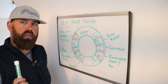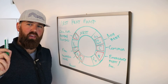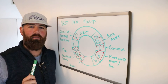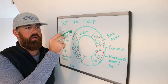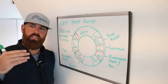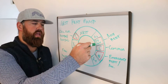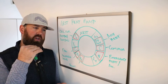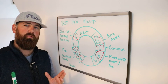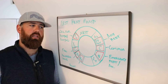The next thing to know about with a heat pump is your W2 or auxiliary heat wire. The W2 auxiliary heat wire is the control for the electrical heating coil inside of your heat pump. Because a heat pump sometimes struggles in temperatures under 40 degrees, the auxiliary system — like a heating coil in a portable electric heater, but bigger — helps the heat pump out. The heat pump can only transfer so much heat when it's really cold outside, so this provides a boost to get the temperature up inside. It is very inefficient since it's straight electric heat.